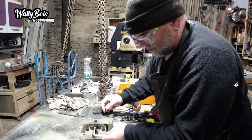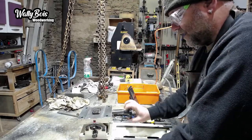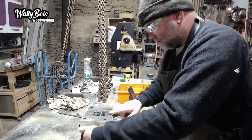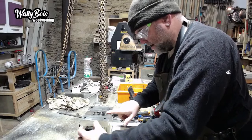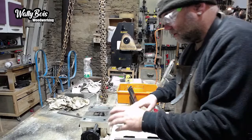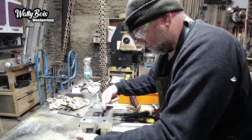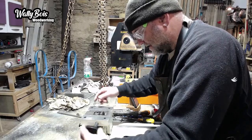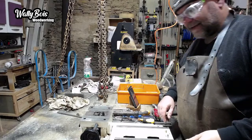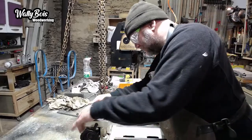So, I release that. Basically, this then can be screwed one way or the other, then you tighten it up on the Allen bolt. So what we've got is like a rack and pinion arrangement here. So it's like a flat cog, with a bit of a curve in it actually, and then the pinion goes like a worm drive, moves it backwards and forwards, and then you lock it off with the Allen key on the back of it. Now, I didn't mark which bolts are which, I might regret later, but we'll see.